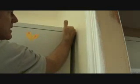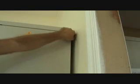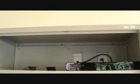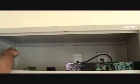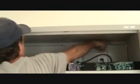So I put that up in there, and I put some long screws in there into the studs. Now as for this wood here, if that bothers you, you can get some paint that matches your wall, and you can go ahead and paint that edge, that end. Here's inside where that top shelf is. See, I got a screw right in there, and one there, and one over there. And I used 3-inch long sheetrock screws with coarse threads. I found the studs up there